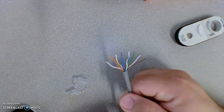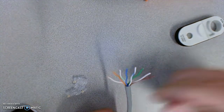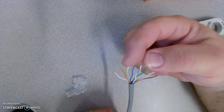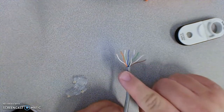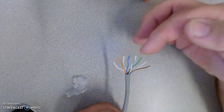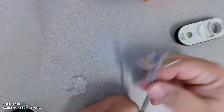The lab paper has a printout for easy viewing. It may seem odd, but from the early days of phone, the center blue pair was phone line one and the two wires around it were phone line two. Our data cabling network system is designed to handle phone as well as data. So our left-to-right color code order is: white-orange, orange, white-green, blue, white-blue, green, white-brown, brown.